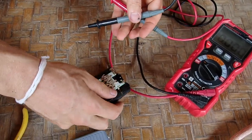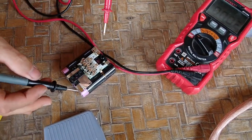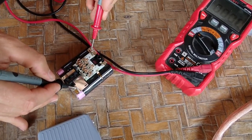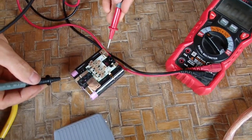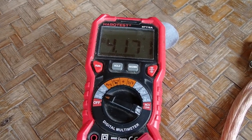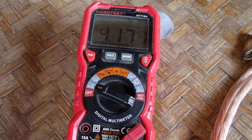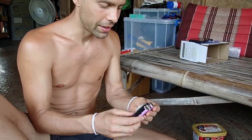We can check if everything is as it should be. With the minus here, the meter will show 12.5V. I charged all the cells beforehand and they are all 4.17 or 4.2V. It's a good idea to charge them all to the same voltage — so they are full — before putting them into a battery pack. The problem with packs like this is that when you charge them, they charge the whole pack at 12V and don't charge each individual cell. If they produced chargers that charged each individual cell to its max, that would be the best.